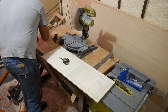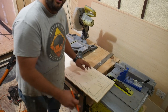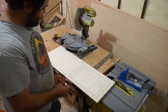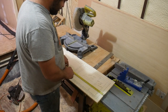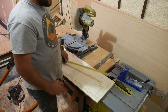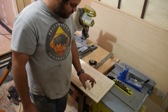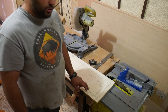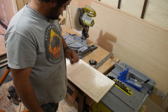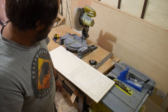I'll just write this down. Now, these two pieces — the overall length is going to be 77½, and I hope I calculated that right. Basically each door is going to be 15½ including the exposed stile, times 5, plus the end one — I hope — 77½. So I don't have any 1-bys that long; I'll have to rip it. So we'll need 5 of these, 1 of these at 77½, 1 of these at 77½, and rip to a 1x2 width.